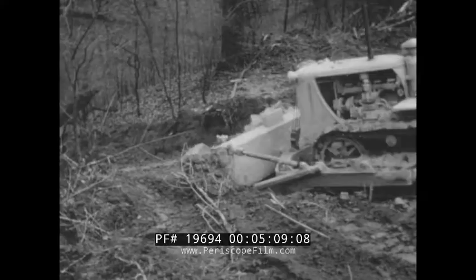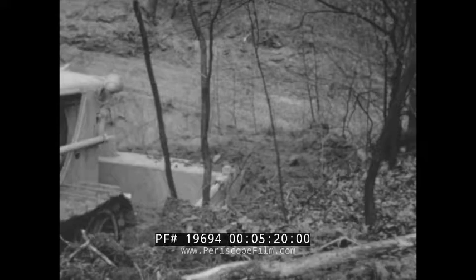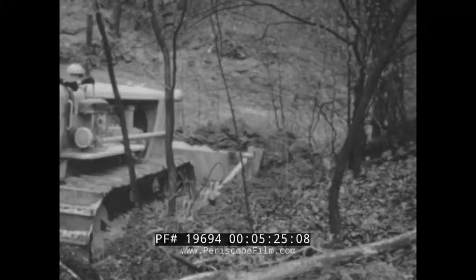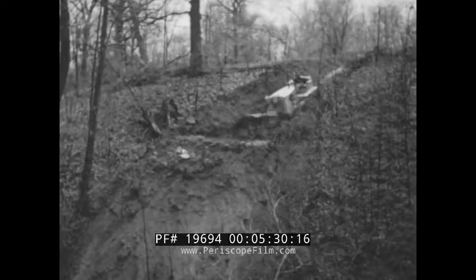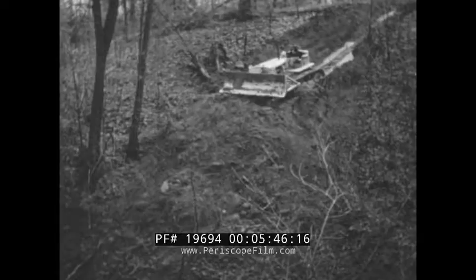Again, the earth rolls and it keeps on rolling. Earth moves easier when it rolls like this, so you get big yardage with the lowest fuel consumption and minimum wear and tear on the tractor. It's the same process all over again, with the blade slicing through roots, trees, and tough soil to get the road pushed through in a hurry. See the tremendous yardage these dozers can handle. Even in moving young mountains, there's that perfect balance between traction, engine power, and blade capacity that is writing new records everywhere in lowest costs on earth.